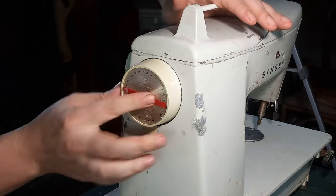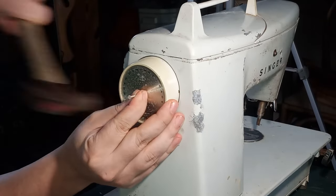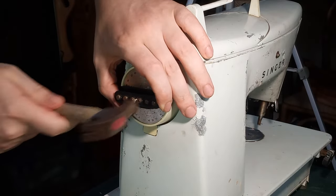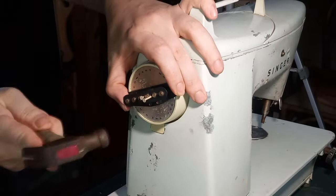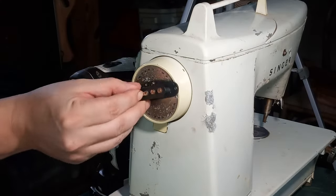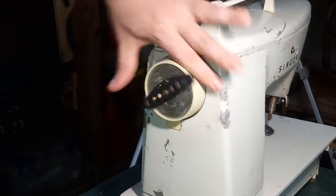But like I said, I'm gonna be winding a lot of pickups. So, most commercially produced pickups have a center pin locator hole. So if I punch and drill a hole right in the center of this flywheel, I'll be able to locate the pickup quickly and tap it right on there. And now that the pickup is mounted on center, I can take finishing nails and tap them through each of the other pickup mounting holes. Now I simply remove the pickup bobbin, drill the two dimples, and now this type of bobbin can be easily and repeatedly centered and quickly and securely mounted using two machine screws.